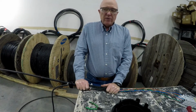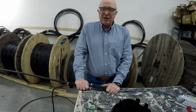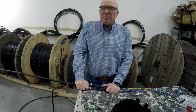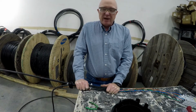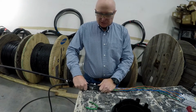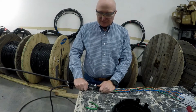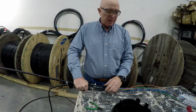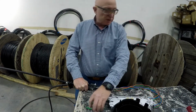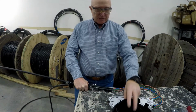We all know that once you're out in an ERS situation, usually you're going to have a contractor out there that has dug up the fiber. So 9 times out of 10 you're going to have an extra pair of hands, and this won't be so, you won't have to be so cautious at this point, because you could have somebody managing this while you put the collars around your trays. But I also want to show, for an example, you could do this by yourself.